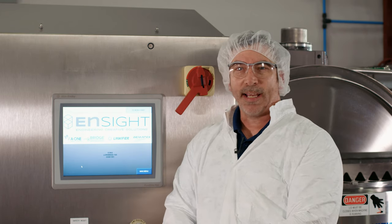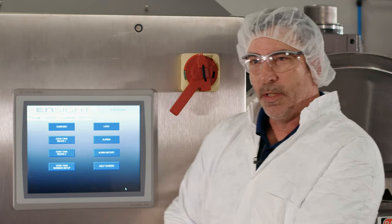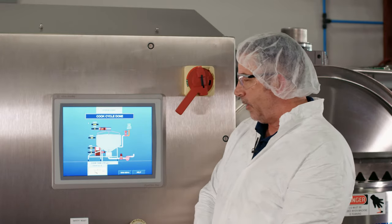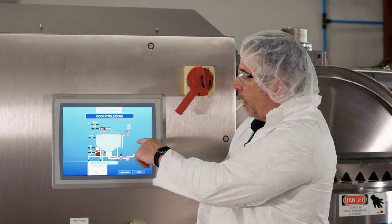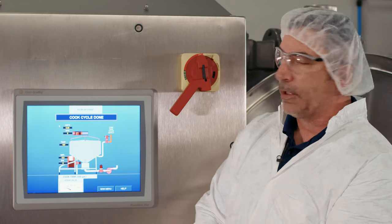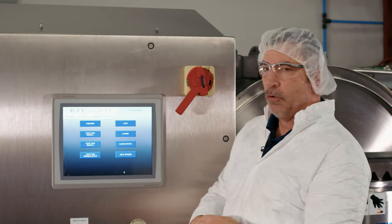In summary, we've created this program using an icing formula with our high-speed LOR WWSS liquefier, which has a jacket and steam valves for control. It's a touchscreen PLC program where you can navigate different screens to implement all the liquefier's functions. The overview screen shows the liquefier's operating stage, amp load of the motors, steam valve open/closed status, and displays a completed cook cycle indicator.